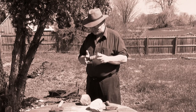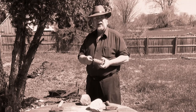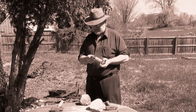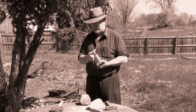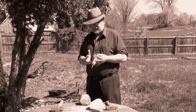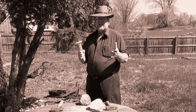This is a two-inch chisel. It's cold forged — just hammered in a large forging press to give it a good material hardness. Often they're only an inch wide. You can also find them at most hardware stores in about a four-inch size, called a brick set. I just wanted to demonstrate for you how stone would have been cut manually for foundation work as part of this series.